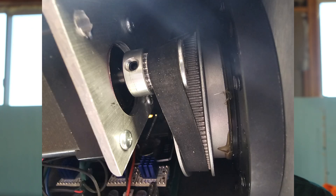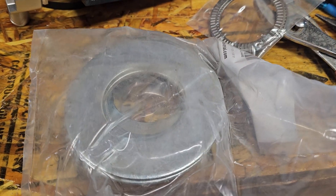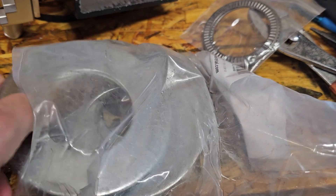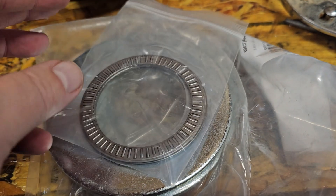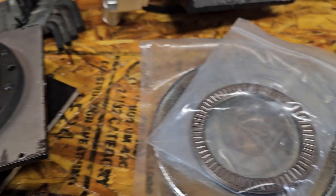Quick update: I thought I had it all put together — the drives fit inside just great. But when I started, the pulley started pulling into the wave generator and it would bind up and stop. So in true redneck fashion, I bought some big washers and some needle bearings, and I put the pulley against those so it would stay in one place. Seems to work. I guess we'll test it when we get some actual clear skies.